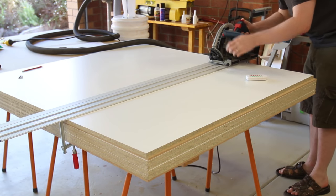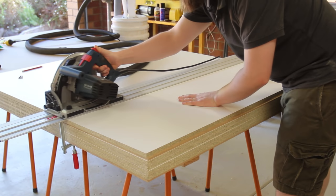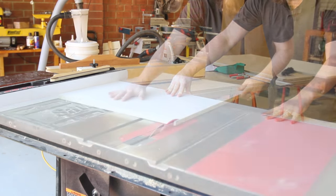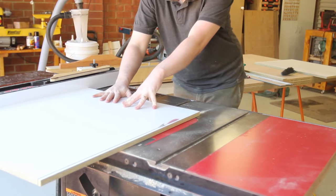The sheet I'm working on is sitting on top of a sheet of 6mm thick MDF as my waste board, which means I won't cut into the boards below it. If you've got the in-feed and out-feed space or a gigantic panel saw, all the sheets could be cut at the table saw. I don't, so using a track saw to break things down and then batch it out of the table saw is the best way for me.